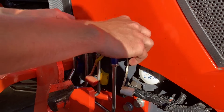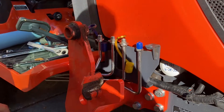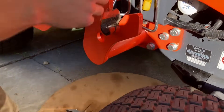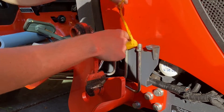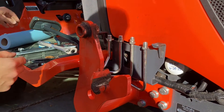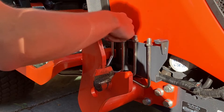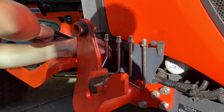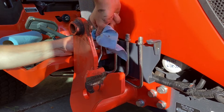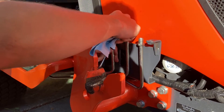You do want to save those bolts because we're going to be using them again. We can kind of just discard that part of the manifold. These dust caps we won't need anymore — the kit has a new set of color-coded dust caps. Now you'll want to remove the old Teflon tape, and then we're going to put some fresh Teflon tape on each one of these.